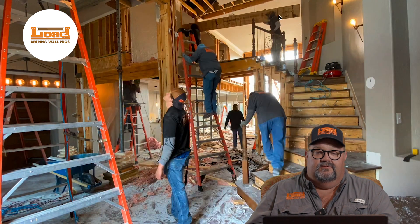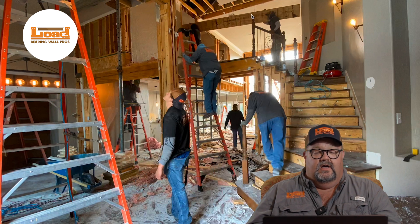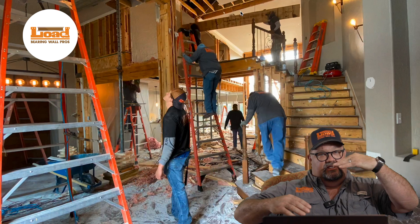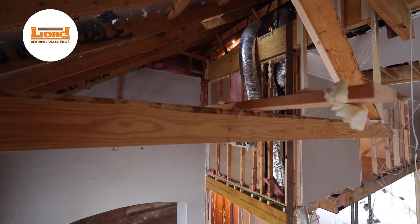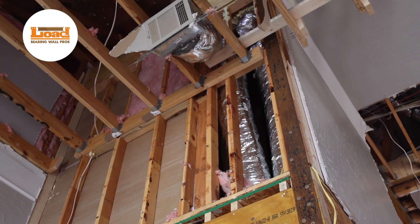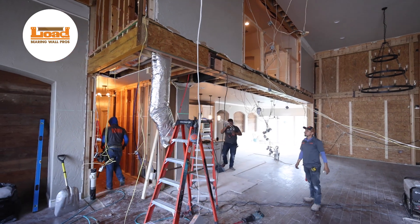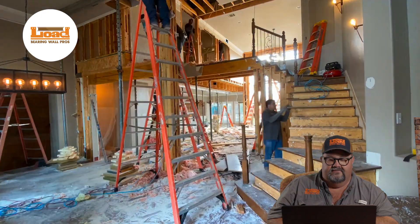You can see right here they're putting this beam into place. That beam is going to go up in the attic and allow us to hang the ceiling. In this scenario we have a first floor in kind of an L shape, and that first floor will be hanging from structure above — up in the attic of the second floor. That gives us strength and allows the kitchen ceiling to effectively hang from the roof structure up in that attic. Let's keep moving forward so I can show you how that looks in the flesh.